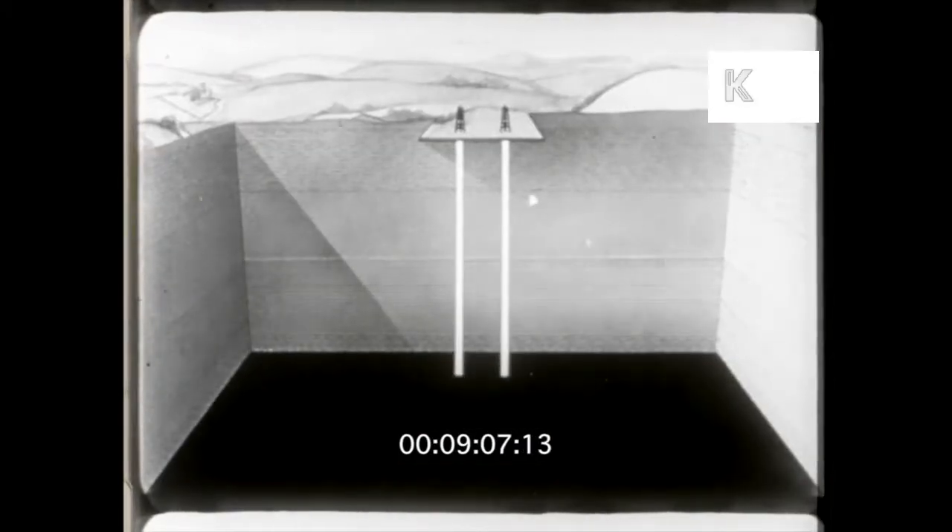The drawing shows how the wall grows bit by bit. Ring after ring of shuttering is put in and concrete is poured behind it until the section of shaft has been lined. This digging and walling goes on until the shafts reach the coal. Then the miners can go down and start developing the mine.